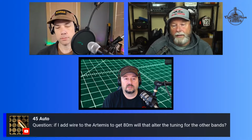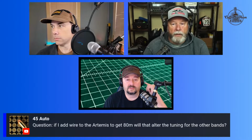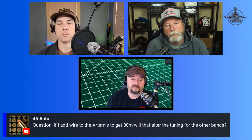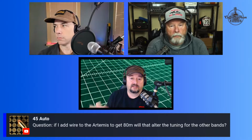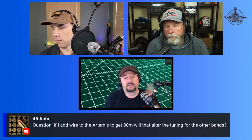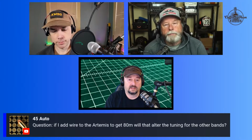Oh yeah. Yeah, well, see, some of this noise is not technically interference, though, right? Like, you could get interference from a power supply, your wife's phone charger, the microwave, the dryer. Phone chargers, that's interference. So when I'm talking about noise, I'm talking more about somebody transmitting 20K up, right? I may get that because my antenna technically can hear that. But the thing is I'm relying on my passband filter at that point in my radio, not my band pass, but my passband filter to filter all that out. And depending upon the strength of that signal and the quality of the passband filtering, you may have a problem or not.